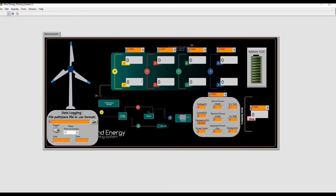Here you can see current and voltage information of the power produced by the wind turbine, or the rectified output. Here we will see the current and voltage measurement of the battery. Here we will see the current and voltage measurement of the DC load. Here we will see the current and voltage measurement of power consumed by the inverter. In the AC section we can see active power, reactive power, and apparent power — all information about whatever AC load is connected to the inverter. Here we can see the RPM of the wind turbine, and here we can see the battery SOC. That is all about the data logging unit.